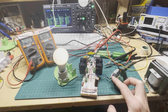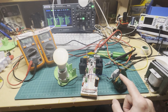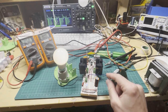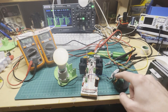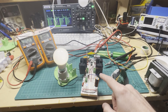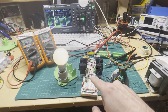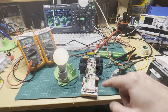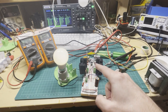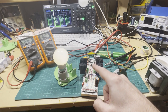So I've got two green wires, which is the primary, and the end of the first wire connected to the start of the second wire is then twisted and connected to the positive of this circuit. So that's the center tap of the primary connected to the green circuit, and then the other two wires are connected to the push-pull of the circuit. So this circuit here is called a DC to AC converter, using the chip called the TL494 chip, which is frequently used for push-pull